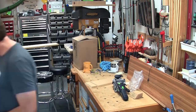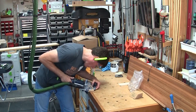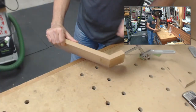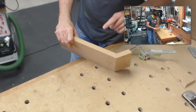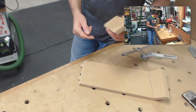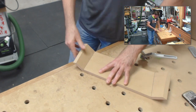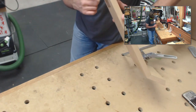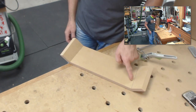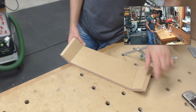Let me do these dominoes. That came out nice and clean. I might want to tune that angle a bit better, because this one here came out great — when it goes in there's nothing wrong with it. What I like about it is I can push it in, let it go, and there's no gap out here and no gap on the inside — that says it's just dead on. But this one here, when I push it in, I've got a bit of a hairline gap — big enough of a hairline gap that it's too much.